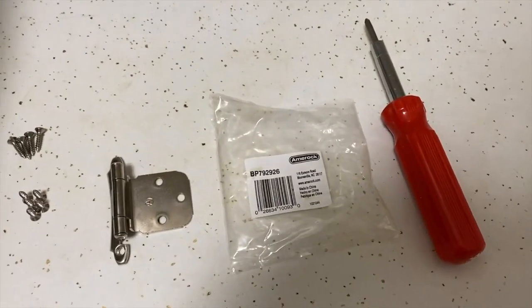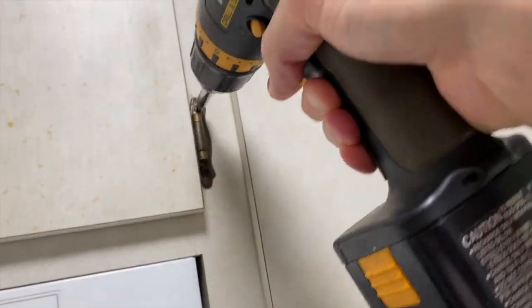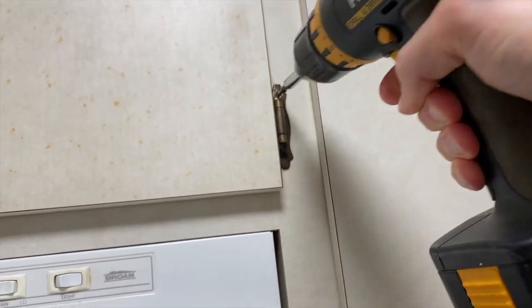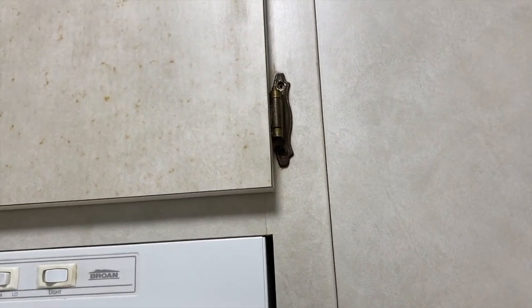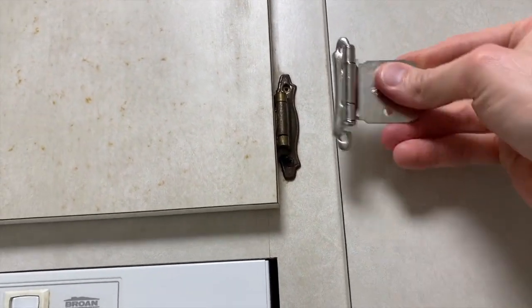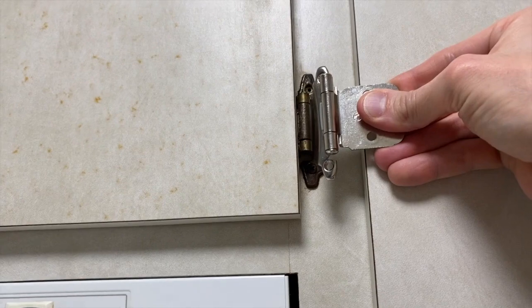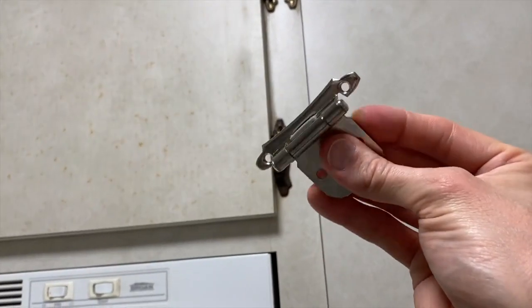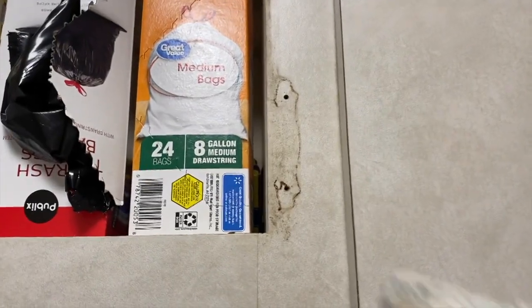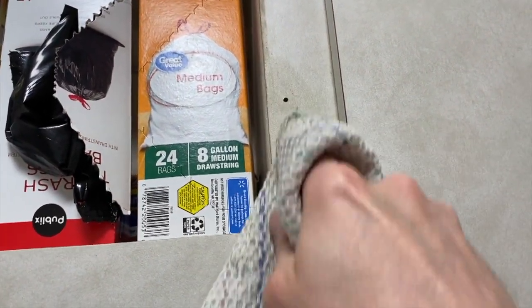In the kitchen now — there's the part number and we're using our drill. These hinges are 50 years old and have some rust on them. We're going to carefully remove these, and chances are once we remove them there might be a stain on the back side to clean off, because the actual size of the new hinge is slightly shorter. However, the screw holes line up perfectly. They certainly left some stains over the years — I'm using a warm soap and water dipped rag and carefully scrubbing off that stain.